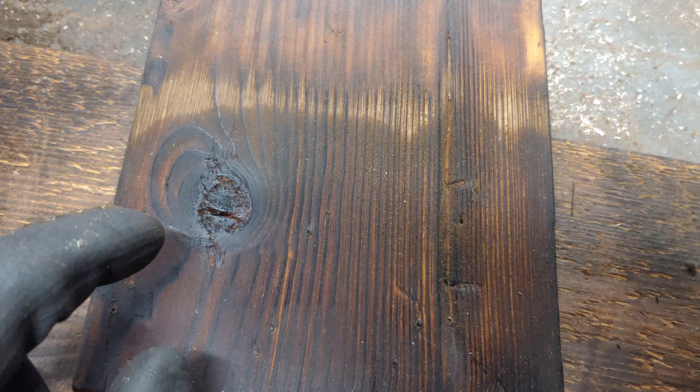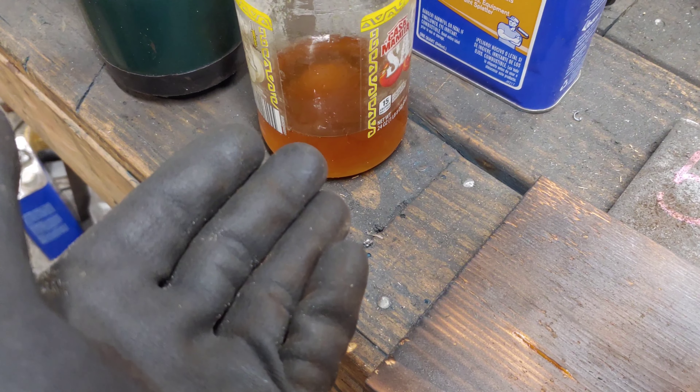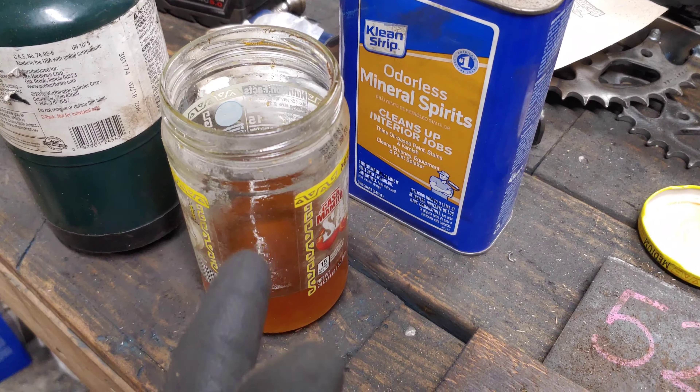Now that there's a decent dark on all of it, you can decide how you want to finish it. I'll show you some things I tested on this piece of the same wood. On this side, it was black when I started — then I took a wire brush, went with the grain, and it digs out the low spots and leaves the high spots, taking out the soft wood and leaving the high dark wood. On this side, I did the same thing but then took sandpaper over top and used boiled linseed oil and mineral spirits, 50-50, wiped it on. That's what they come out as. I'm going to go with this side — a relatively light burn where you can still see it's not all black — 100-grit sandpaper over it, then that same boiled linseed oil and mineral spirits wiped on. This is what it looks like after sanding, and this is with the boiled linseed oil on it.